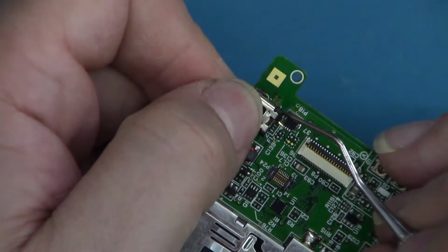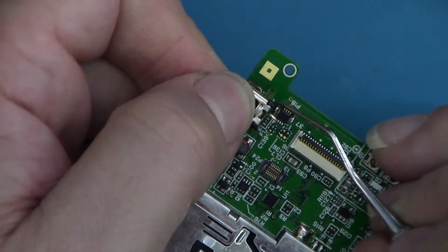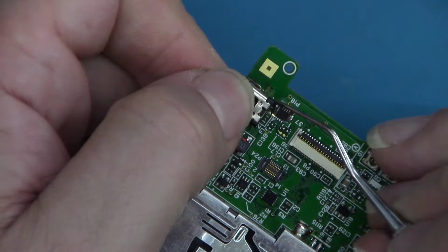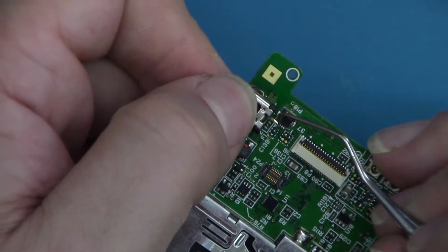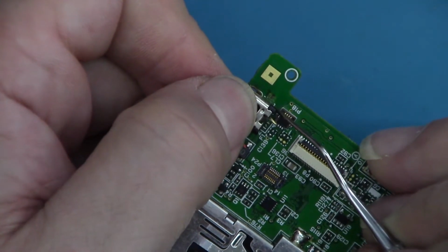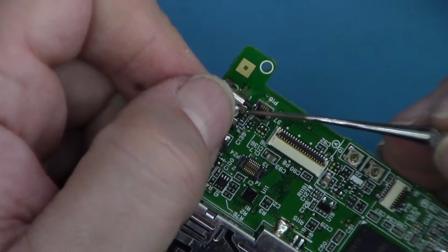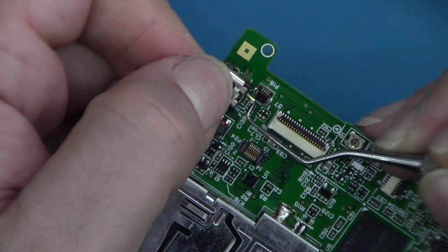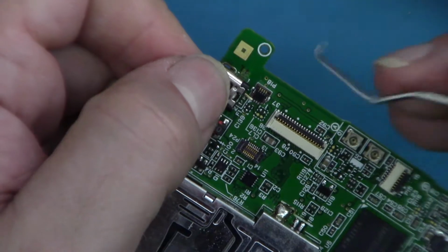I've pulled it across a bit to come to the fuse, so I think if I cut it off here now, it's going to be clear of this connector. If I put it there, then I can easily bridge across there with an enamel wire or even a piece of solder. So I think what I'll do is cut that now, then solder this into place, and then look at making these connections good. But I think we're more or less there.